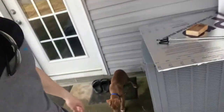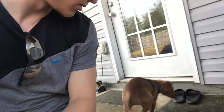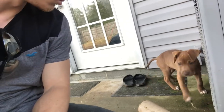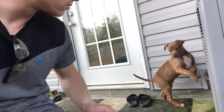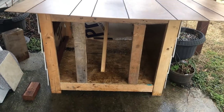I'm going to go ahead and do that, making it as thick as possible and making a better installation overall. This is exactly what I'm talking about — I have a bunch of leftover bubble wrap and I'm just going to put it up between the insulation and the outside, making it bulge out a little more so that whenever I'm installing the wall it'll be nice and flush with the outside pillars of that two-by-four. We also have a dog next door and this guy is just a wuss — he is running from everything.